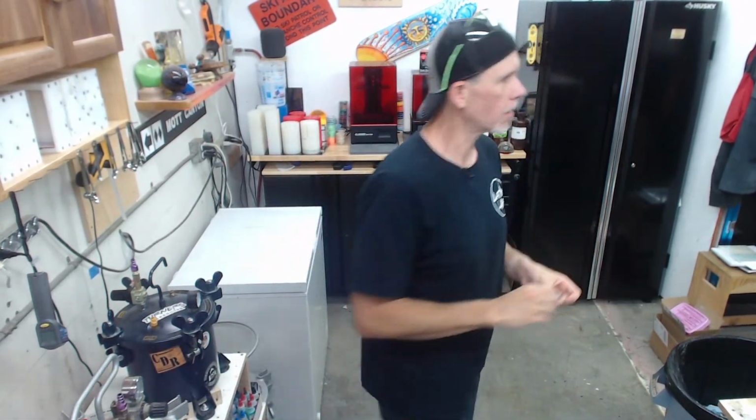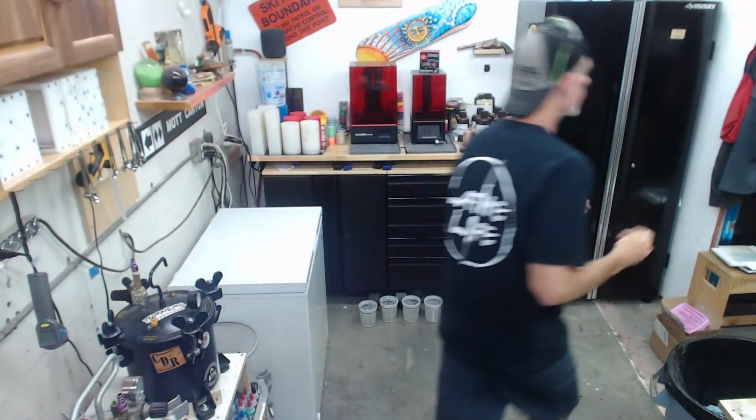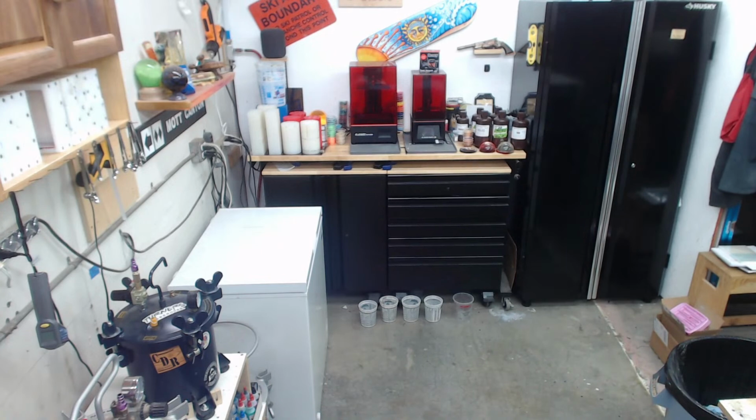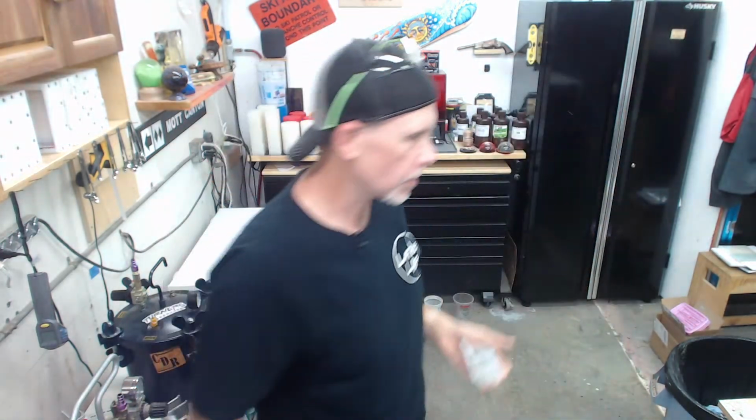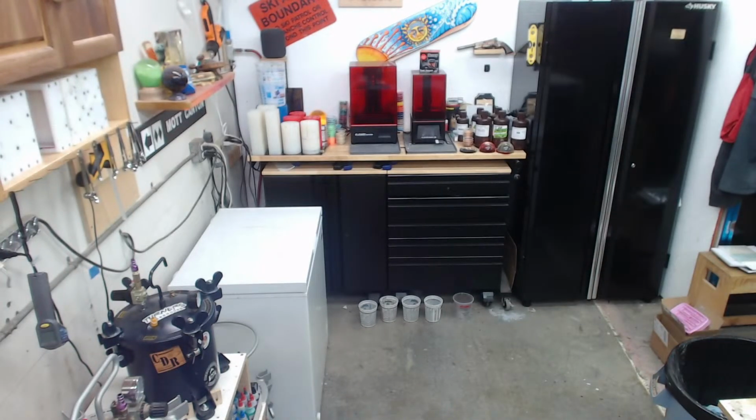Like I said, I'm going to pick one of those up because I had this other one. Let me just show you the other one that I have, and it just doesn't make sense. There's a specific set of tools that come with some of the barrel trimmers, and I don't have them, so this thing is completely useless. It's somewhat similar, a kind of fence type of deal where you would mount the blank, but this is the same size as a mandrel. The problem is you can't use your standard bushings because you need one on the front too. There are these longer cylinders that work with barrel trimmers, and that's how you would have to use this, but I don't have those cylinders and I don't want them. So, not very good. I'm going to get the good one from Turner's Warehouse.